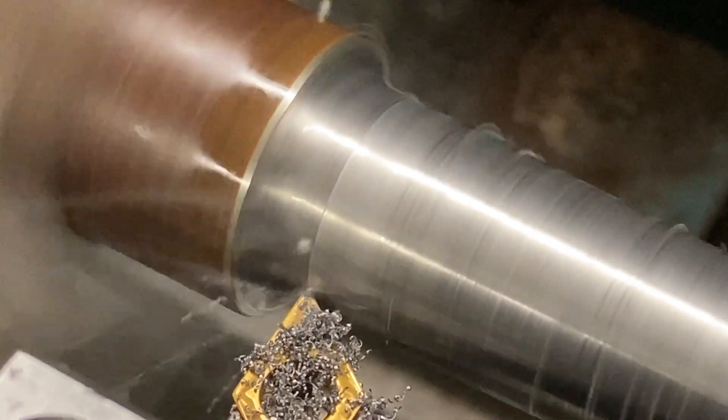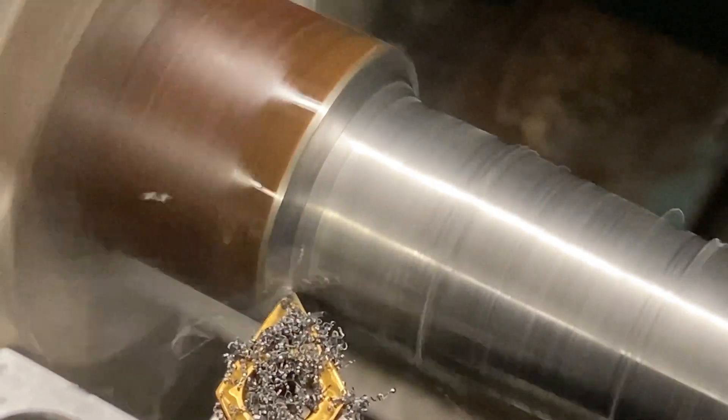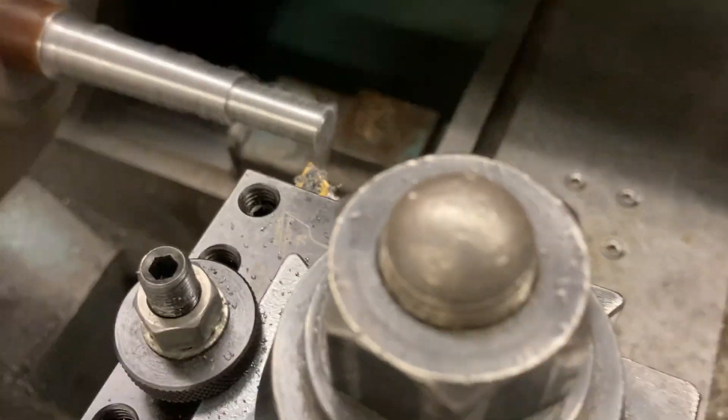There again we've got another radius over here. We're turning 750 diameter straight, then once we came off the table there's a one-eighth inch radius in there. Now she gets out of the way.